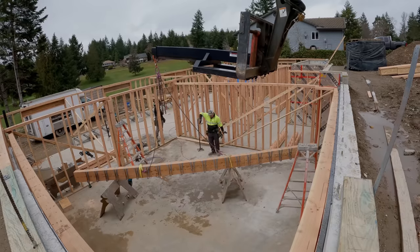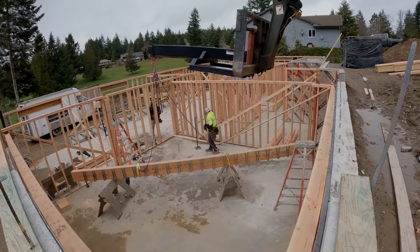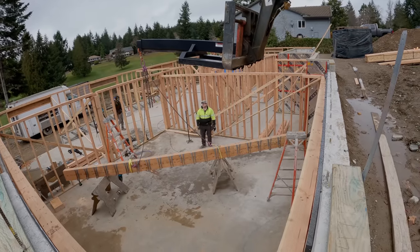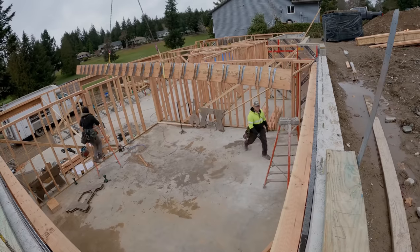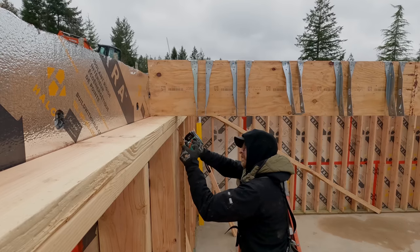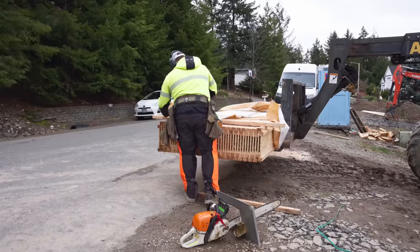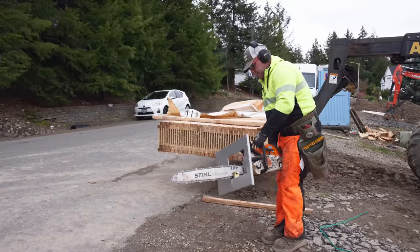Now this is how we got the beam down in there, and now it's going to be how we raise the beam. Look at all those hangers — 12-inch on center. We're going to have a center column down to that big pier pad, which is going to support the garage slab plus two vehicles plus a safety factor. Somebody on YouTube recently made the comment that forklifts are too expensive — I would argue pretty vociferously we've been running forklifts since 2002. It is too expensive not to be using a machine.